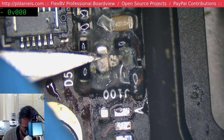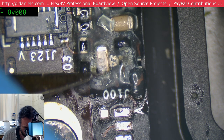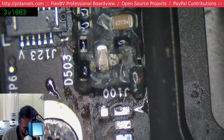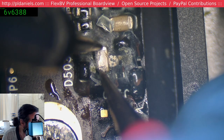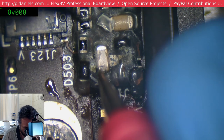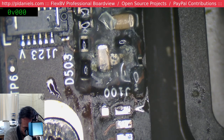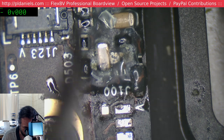I don't think I caused those chips, because my blade was not in that area. Now, this one's caploded on its own. Well, it's a decent sized cap. I'd say it could be 1 microfarad, 25 volts, or... Okay, I can't measure the resistance across that, because I think there's a voltage. Yeah, 6 volts. That battery's alive. But then it can't be shorted, because if it was shorted, it wouldn't have any power.